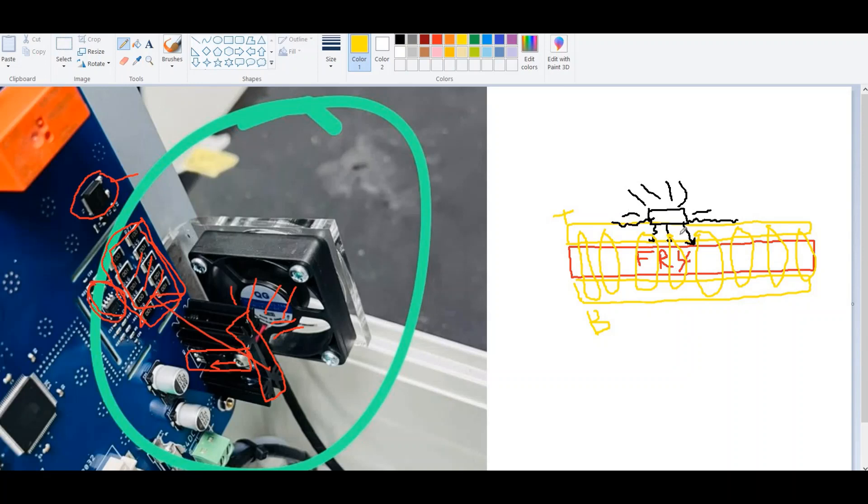Be careful when using this technique. The first thing to make sure is that the top and the bottom layer should carry the same signal. For example, if the top layer of this package is ground, then the bottom layer should also be ground. Otherwise, any different signal will be shorted through this via, which is very dangerous.